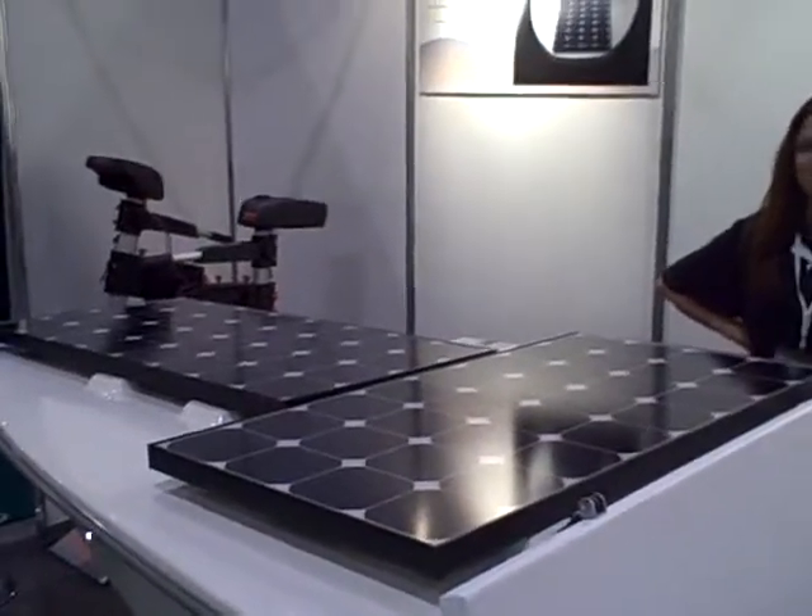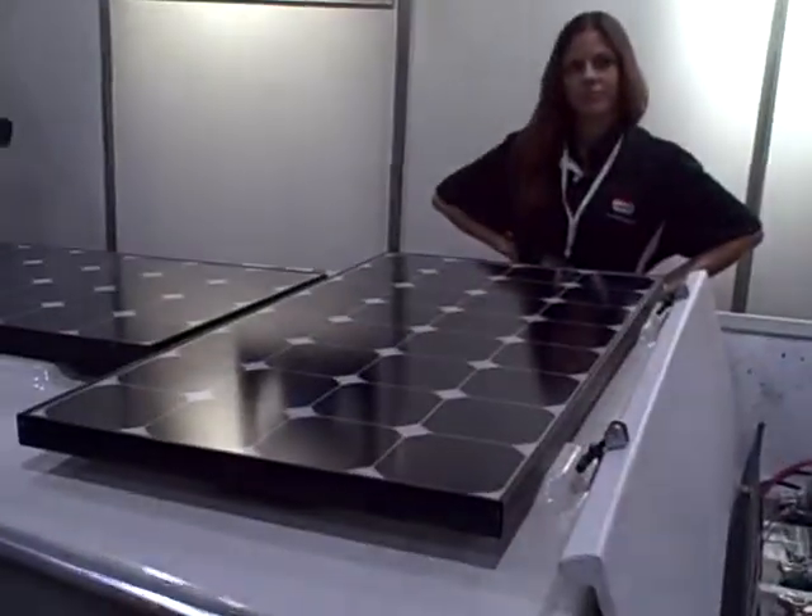Essentially what you have on the boat is on the deck. We have two 90-watt solar panels here on the deck — so two 90 watts each. They're connected together in series. They're 12-volt panels connected in series, so we effectively have a 24-volt panel.